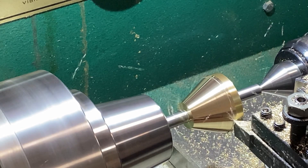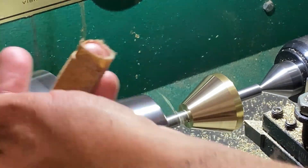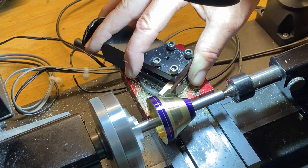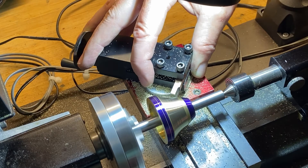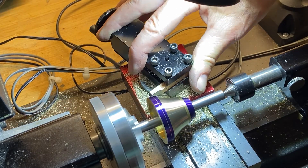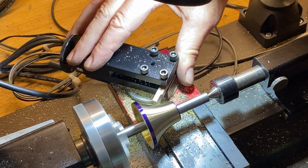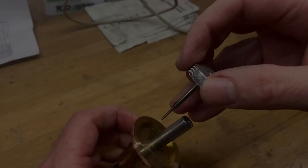What this does is remove most of the material of that Fusee before we go in and cut that angle — and there's a little bit of a trick to doing that. Here you see that trick. I've got this on a Schaublin lathe with a reverse cut. Basically that thing is pivoted on the radius shown on the drawing. You see I use the DRO to see when everything goes away, and then I've got my curve.